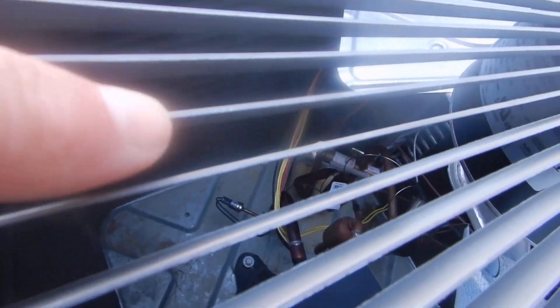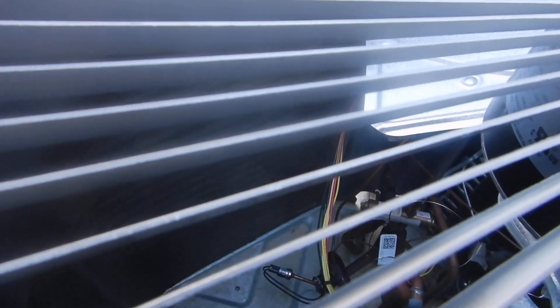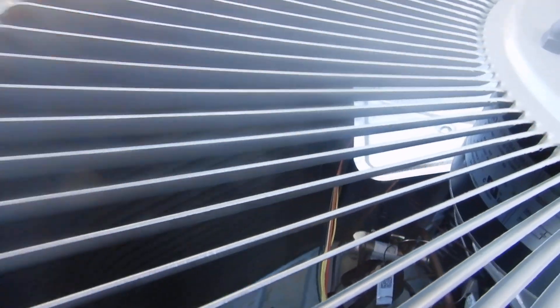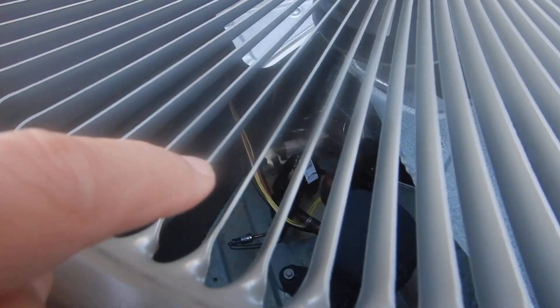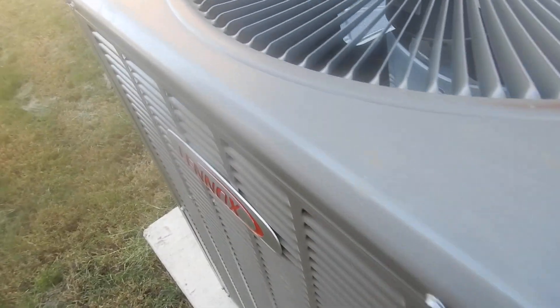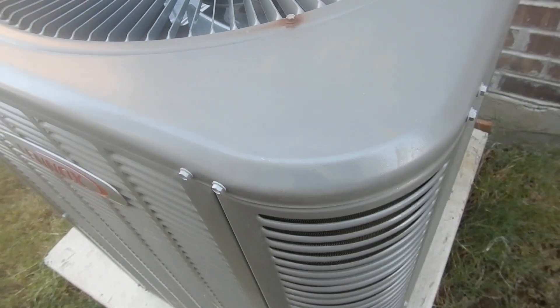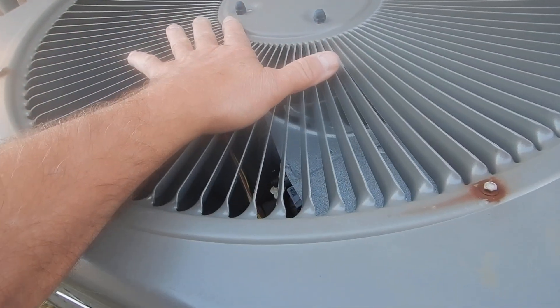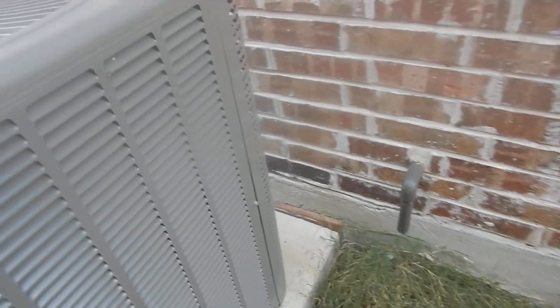Come in here — we have a heat pump system. See that heat pump reversing valve and those pressure valves? No longer manufactured. If it's on the shelf, they can sell it, but they're not making those anymore. See that compressor in there? They're no longer manufacturing those either. If there's one on the shelf, they can sell you one. You'll probably always be able to buy a fan motor, but anything that has to do with the 410A refrigerant is no longer manufactured.